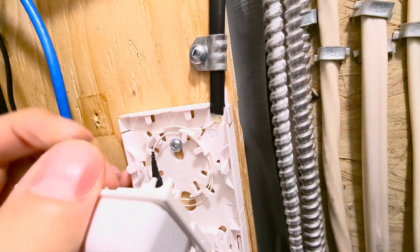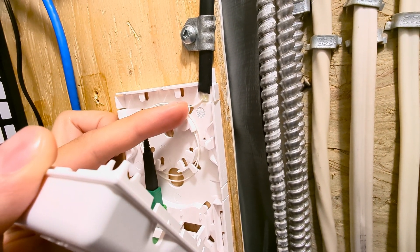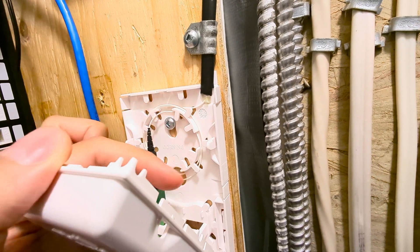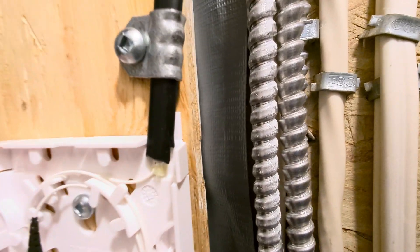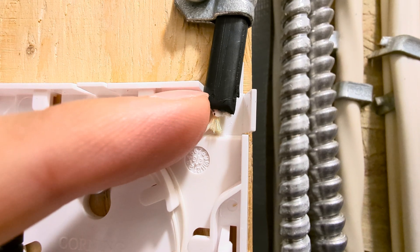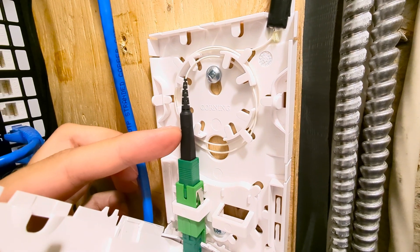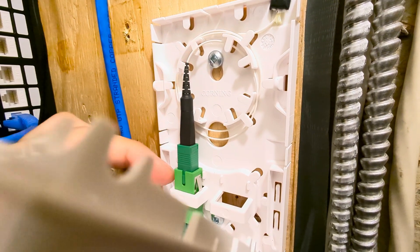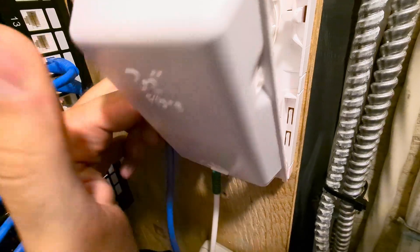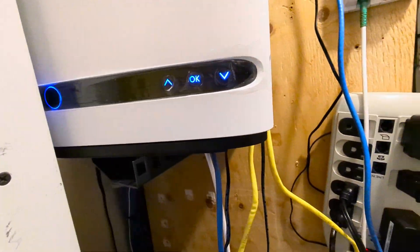Another thing I'm not happy with is this bend — the Bell technician messed this up. I told him not to do that. Some cables you can kind of bend like this but it's still not recommended; the best thing would be to go straight and slip around — I'll redo this eventually. If you look closely, you literally have fiber cable inside of a fiber cable inside of a fiber cable — three cables. There's an SC connector terminated to this fiber cable, goes into a coupler, and exits via another SC connector into the modem — the Giga Hub in this case.